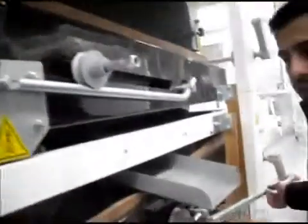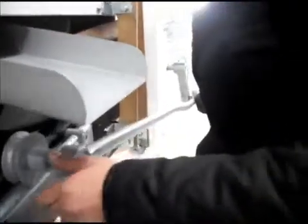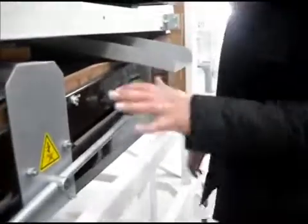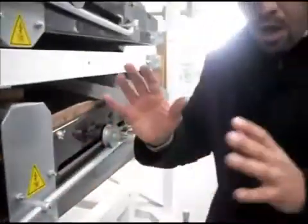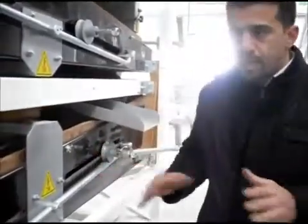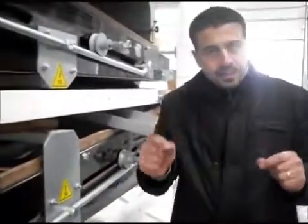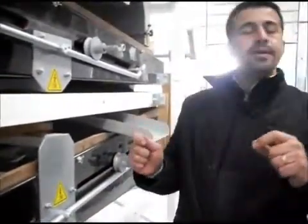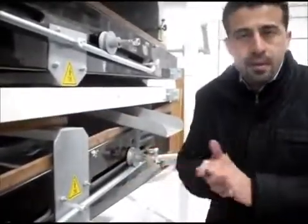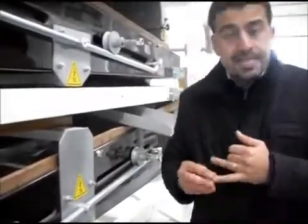The screen perforations are kept blind-free, block free, by these brushes. There are 5 brushes. Because the holes are kept 100% open every second, because this keeps moving, your analysis is better. There is no way a seed will be stuck in the perforation for a long time, and this will deliver you a higher analysis of grading as well as screen cleaning.